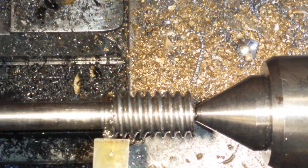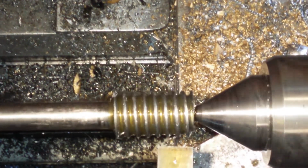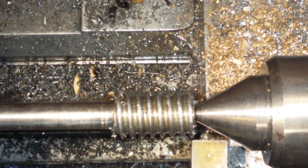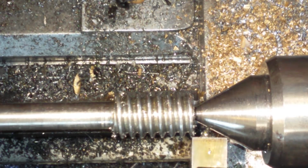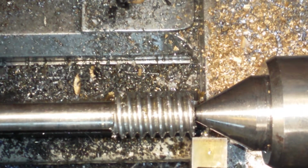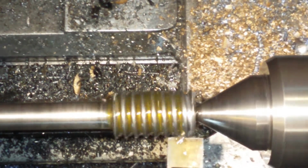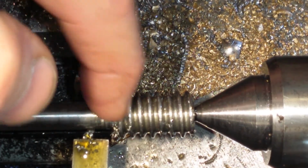Take one more thousandths by machine power. Just gives a more consistent feed, I think. Zero plus one. It all looks good. Glass is on, because it's going to start spitting chips at high speed everywhere, more than likely. And we will do that. Here we go. This is it. It's going to happen. And into gear. Otherwise, we're just going to. Because it's not in gear. Wheel on. Here we go. Is it in forwards? Oh, yeah. Bit struggled to do that, but that'll do.